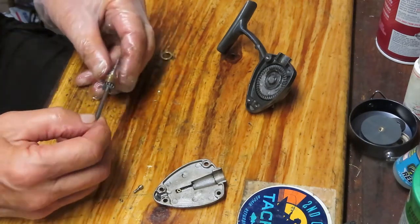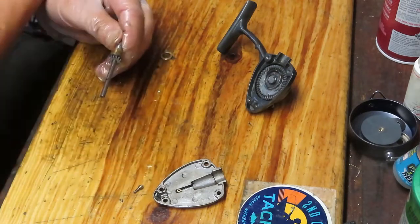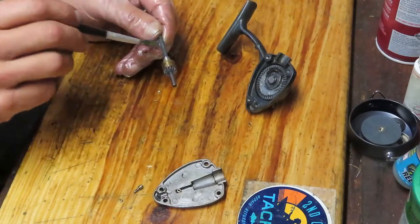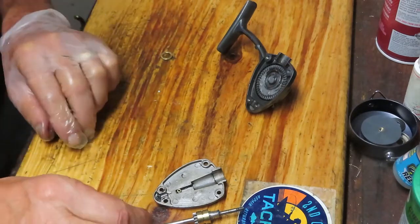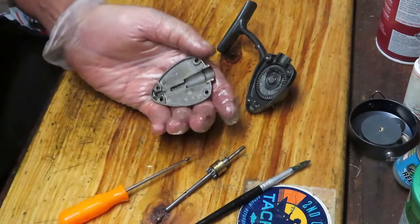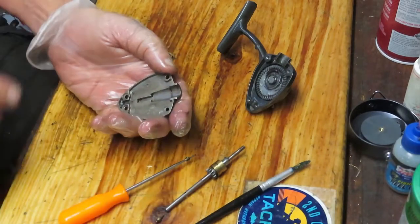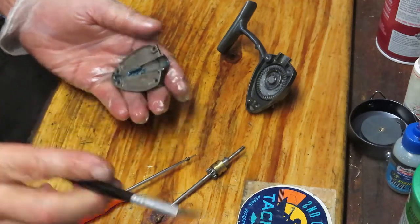Axle shaft in from the top — it's easier. It's running a little bit of difficulty there. We'll grab our grease and our grease brush. I use Penn Precision Reel Grease for this. Slide it down, get a little grease up top — don't over-grease this, it's going to be pressed out if you do. That assembly can come up now, sit that off to the side. Put the pin half in on this. As I mentioned, there's a little bushing that's going to ride with that second part of the pin. Clean out the rest of this case and give that grease brush one more time at the slot where that bushing is going to be.